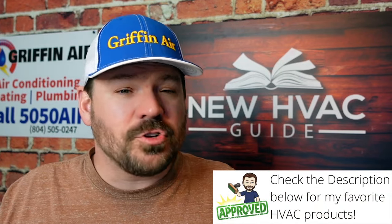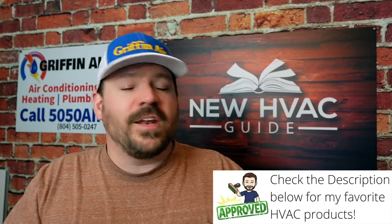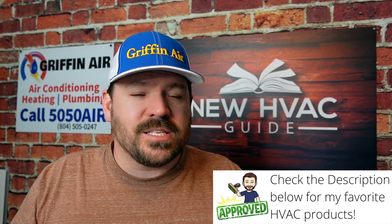If a system is operating correctly, you don't want somebody connecting gauges every tune-up. These systems don't hold a lot of refrigerant anyway. After two years of preventative maintenance visits where technicians keep connecting gauges, depending on hose length and other factors, you could be removing a little bit of refrigerant every single time. Eventually you find out the system is a few ounces low — if not more — and that creates more problems.